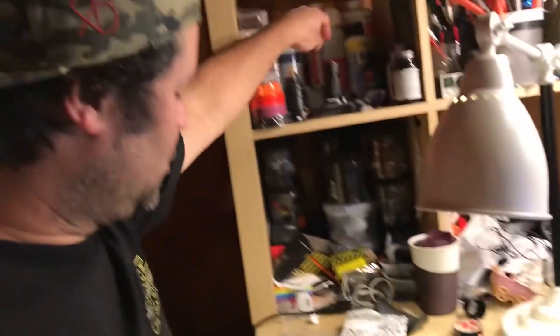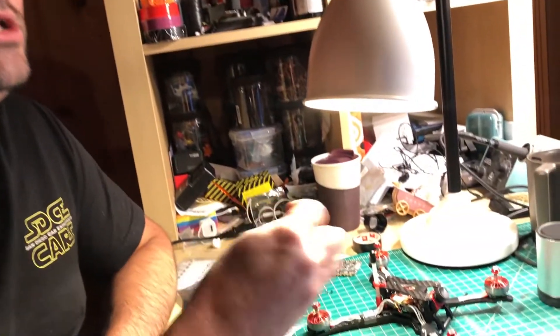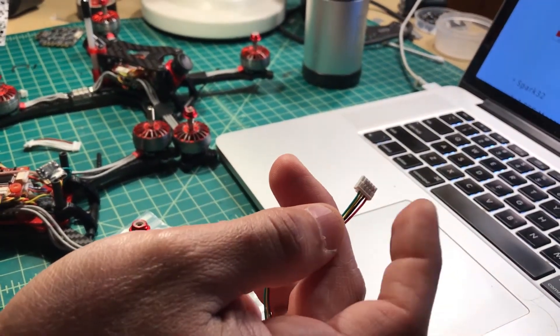So let's recap: unless you're going to completely avoid plugs — which you probably won't — something you buy is going to have them. I really recommend you buy some of these kits and have them lying around, because when the day comes that you're building a quad and need a wire, you'll have it and won't have to wait for an order. Make sure to have especially JST SH to JST SH — you're gonna need that. JST SH to Pico Blade is important for cameras. JST GH is mostly used for a few VTXs so you may not need that one. Also save whatever cables come with things you buy — you might need them in the future.